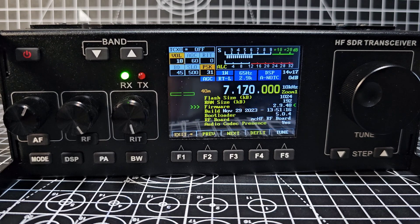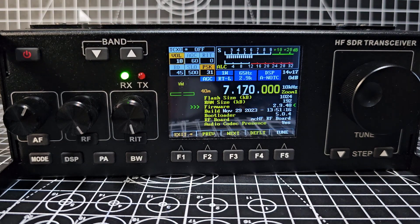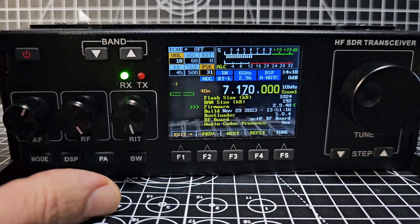So it is a two-pronged process if you do it this way. If you buy one of these and they've already got the newer bootloader, then you're fine. You'll see in this video the latter part where you just put the new firmware on a USB stick, hold down one of these buttons and the power, and it just loads — it's really simple. But if you need to add the bootloader, that's a bit more complicated. Remember when you do load firmware, you're going to wipe all the settings, and these devices need to be calibrated, otherwise they will overheat when you transmit.